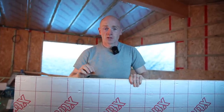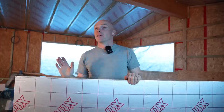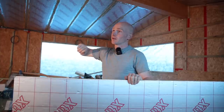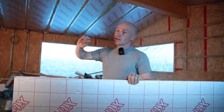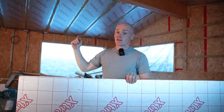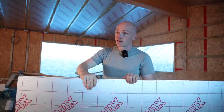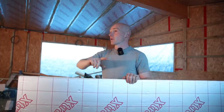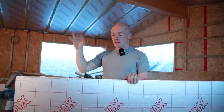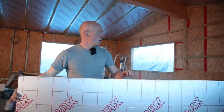So you now know what we're doing. There are two options here. You could buy insulated plasterboard where you've got your insulation with the plasterboard bonded to it, get a plasterboard lift, wind it up against the ceiling, put your screws in and you're done. What we're going to do is slightly different - just get the insulation in place and then screw regular plasterboard through, which saves a little bit of money. But also we are going to be insulating and then putting battens underneath so we can run our lighting cables and any other cables - speakers, whatever we want - in that void. Then we can put any finish we want, and in our case we're going to be using a lightweight panelling. Enough of the waffle, let's crack on.